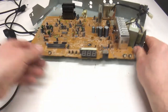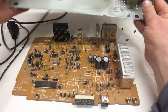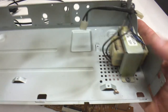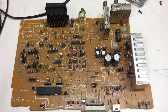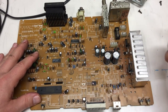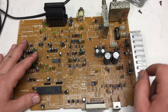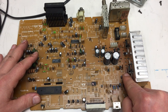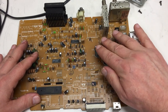That board was pretty well screwed down in there. Besides the transformer, nothing is left here in the chassis — which is consumer electronics: very cheaply produced but effective. AC comes in here, is fused, goes back to the transformer. From the transformer, four lines come back in. We probably have two voltage regulators — marked U402 and U401, not T, not transistors. A lot of filtering. And that's the power supply.